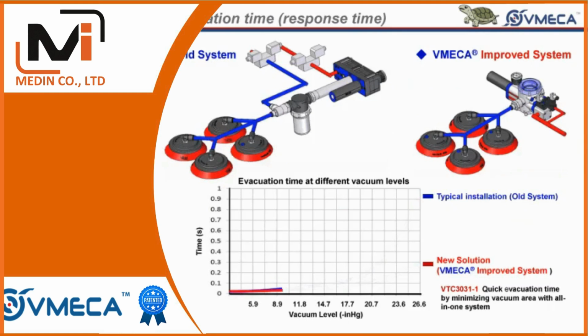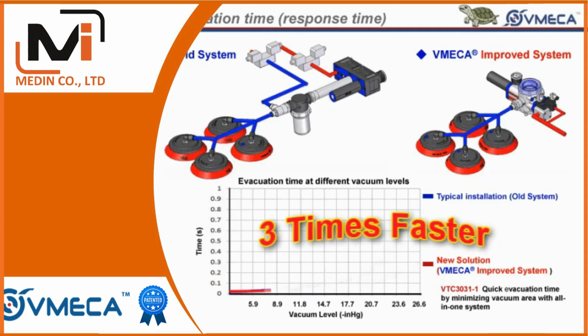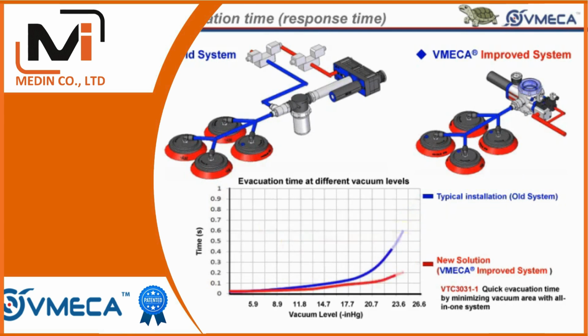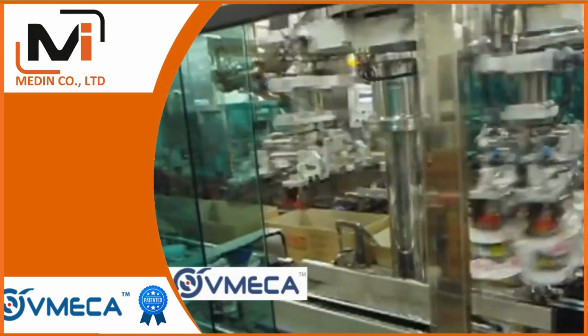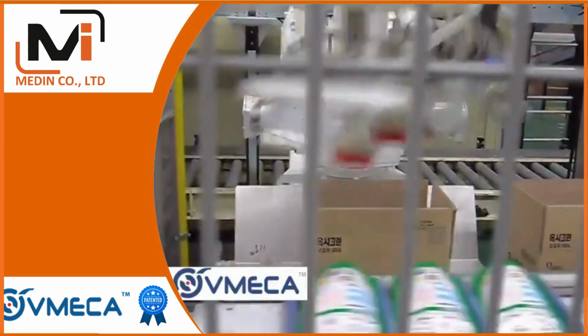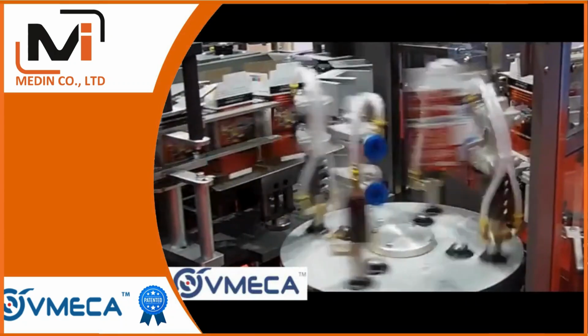Right around negative 26" mercury to negative 27" mercury, the response time for the turtle pump is almost 3 times faster. The reason for this is because you are able to install the pump close to the point of use, so achieving vacuum with the turtle pump will have a very quick response.